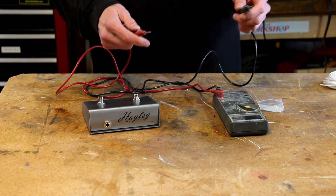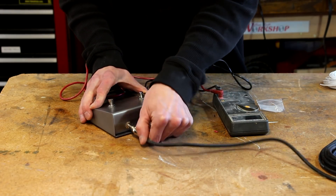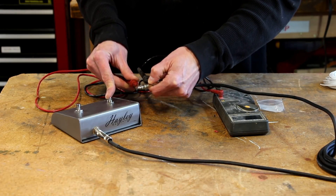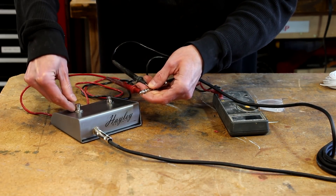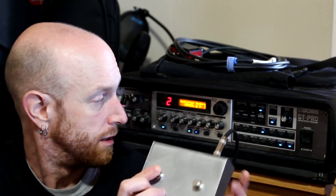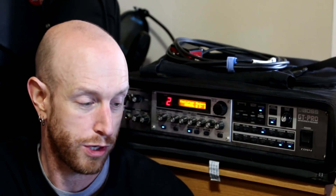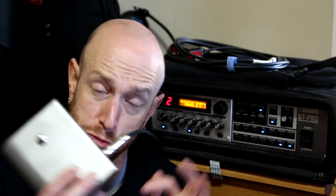To test this out, I've got my multimeter set to continuity with an audible signal. I'll take the cable, plug it in - that one's good. So now I've got the pedal inside, I'm going to plug in my cable and let's try this out. I press the momentary button and I can see those lights are switching, so I know the momentary is working. But when I press the on-off switch, nothing changes. I've got some parameters set up that are supposed to go to that button, but nothing happens. I believe I have just learned something about my processor that I did not know before.